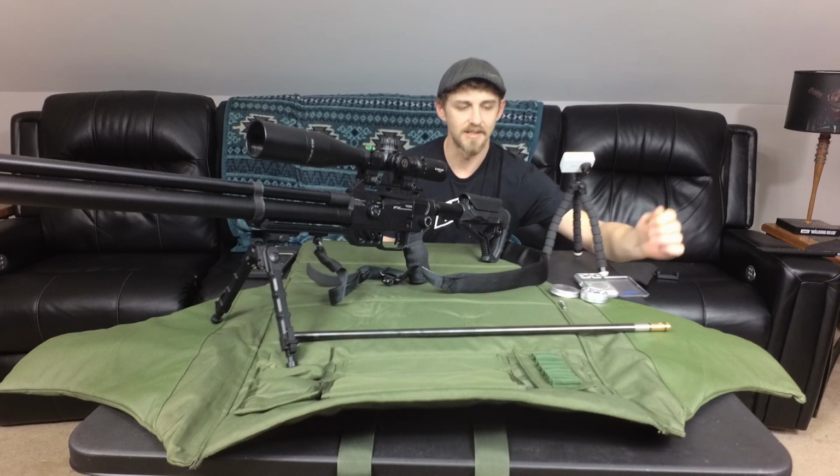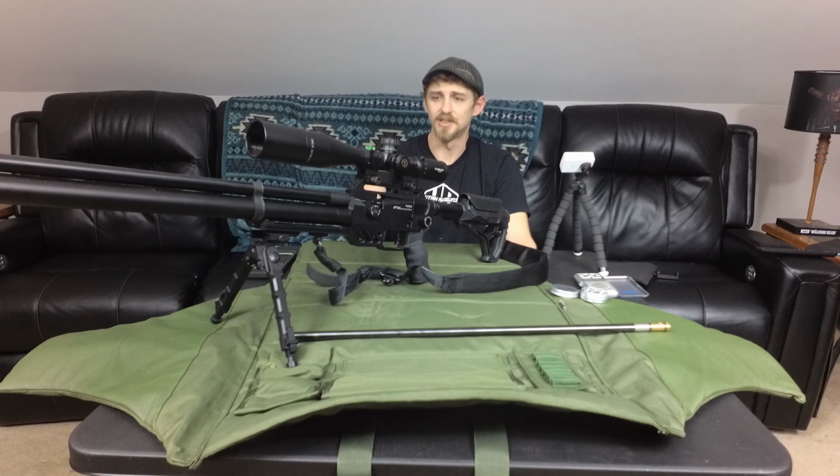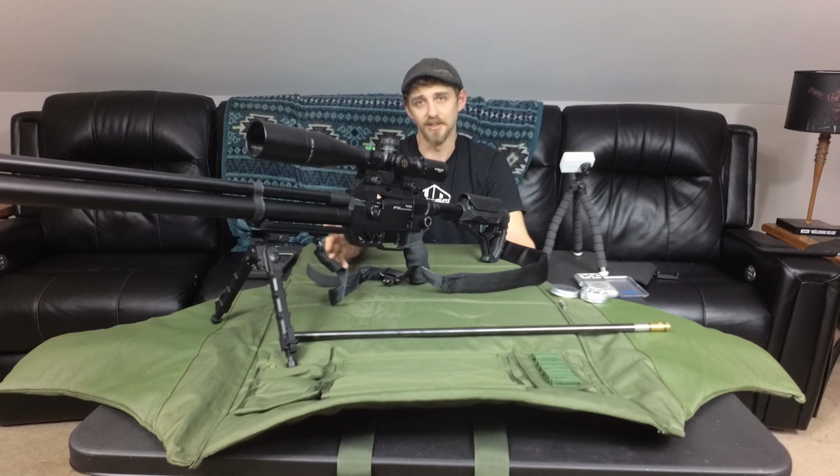They like going fast. In my other video, I hadn't done any tuning. This is really just as soon as I got this thing put together and I started doing some testing just to see where it was at, which was about 140 bar with a really heavy hammer. And I figured, you know, we'll just get some power numbers and see what we're shooting. And it came out to about 49, maybe 50 foot-pounds without going crazy. That was at 140 bar.